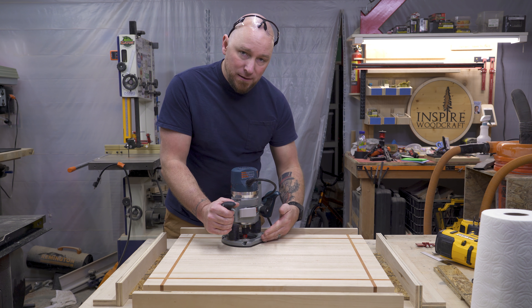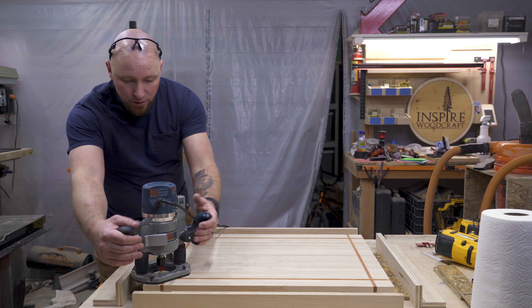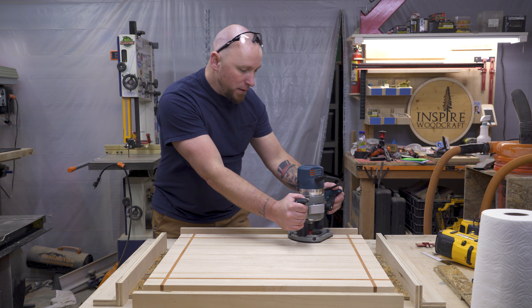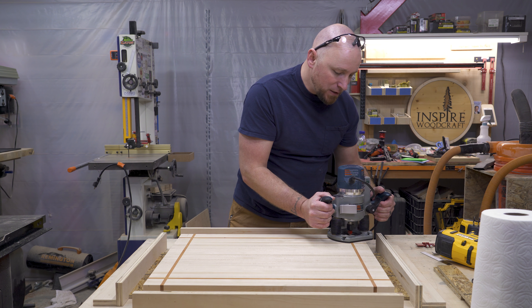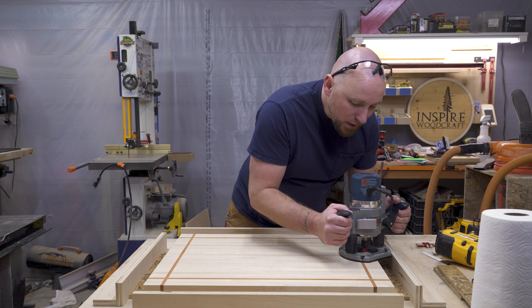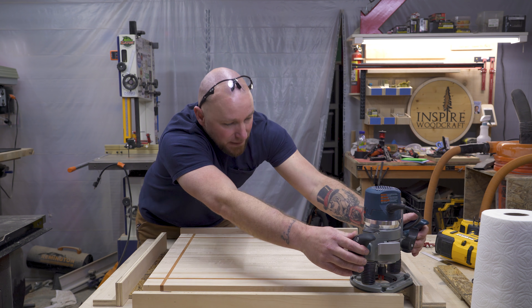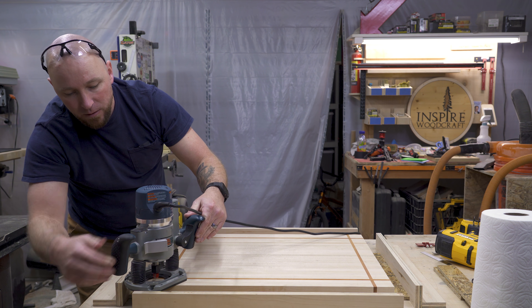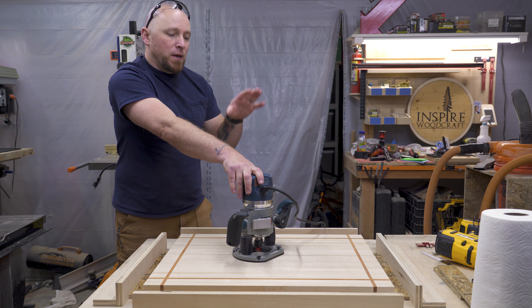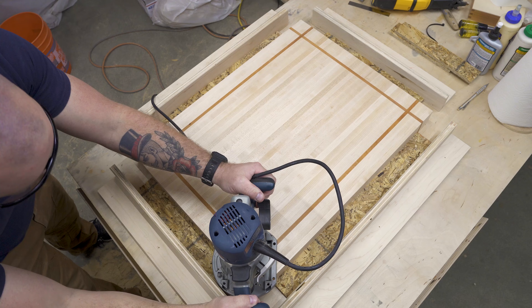What I'm going to do is leave the flat spot at roughly a 45 into my corners. So as I do my dry run, I'll probably start on this corner, come down like this while angling the router. As I come into a corner I'll turn and pivot just a little bit so I'm touching round-to-round on my base to the corner, then push forward, turn slightly, and go into the next corner — always touching round to round. Then I simply drag back, touching round and round again, come back through, turn the depth step down one, and keep going for all my passes. Once we start this groove, if we screw it up we have to get creative to fix it, so let's go ahead and turn it on and see how it goes.